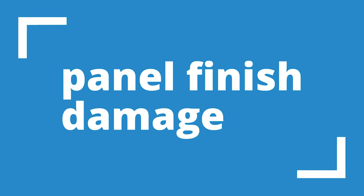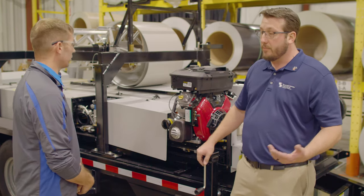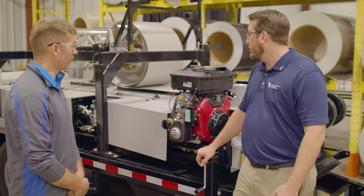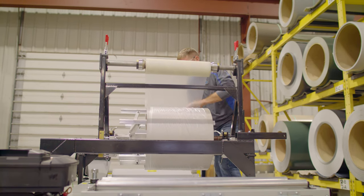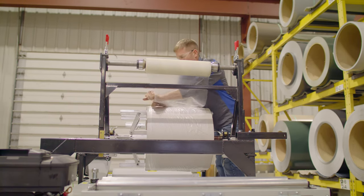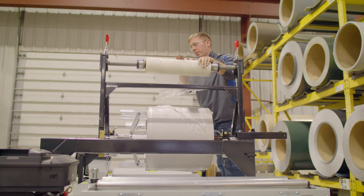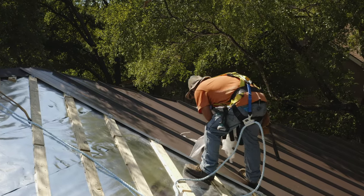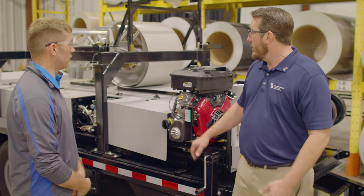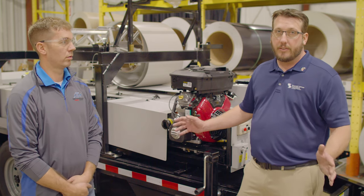One of the other things I've noticed is the panel finish of a metal panel getting messed up during roll forming — the coil goes in and when it comes out, the panel has scratches on it. Common causes include the coil not being wrapped properly, not being stored properly, or getting dirt on it while driving down the street with it on your machine, which then transfers through to the roll forming. Also, if you're using film, film getting built up on your rollers can affect the panel finish. So you want to make sure your rollers are clean and the material you're putting in is clean so the finished product comes out as nice as possible.